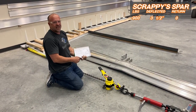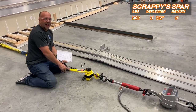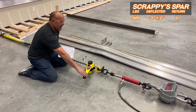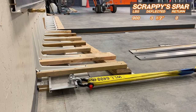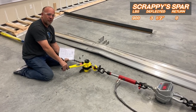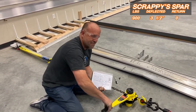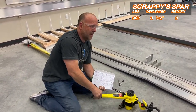You can't just increase the spars, front and rear, which is what I've just done, to hit it. Everything else, the brackets, the struts, the bolts, the tie-in, the weld points. You have to chase down every component to its weakest link. And on Scrappy, the weakest link is actually whatever this spar is, because all my bolt points, my attach points, my struts, everything is the magnitude of multiple times over the max I'll ever get out of this spar. So everything has been changed to match. It's not just a spar. So nobody thinks you can just increase the spar and then have the plane fly it.